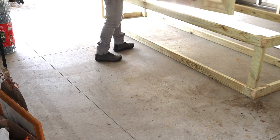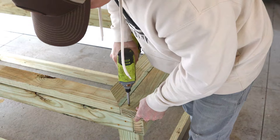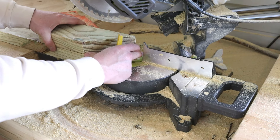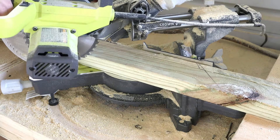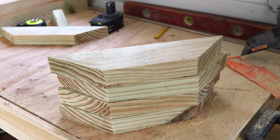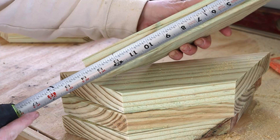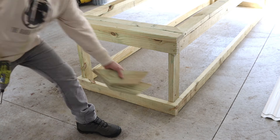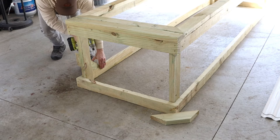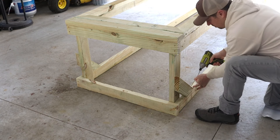We're going to have so much cage wire and corrugated plastic on it that it's going to stick together really well. We're going to sink the last 36-inch 2x4 into the end — this will make everything fit correctly. Then we're going to get started on our upright supports. These are 13.5-inch pieces cut at 45 degrees on each side. We're going to put a couple of screws on the top and then sink one going down into the frame, and this will keep everything sturdy.